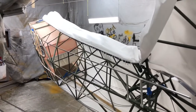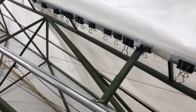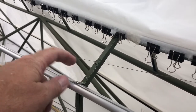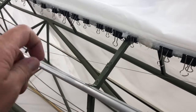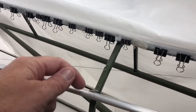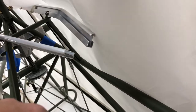What I done is I cleaned those up and made some new brackets. Back behind the paint booth over in the corner — it's just little thin strips of steel, real strong and sturdy, pretty tough to bend. I riveted them to the formers, then turned them up, drilled them out, and put a little sheet metal screw in them. This channel here is kind of arched on top, and this stuff is so strong I don't think it's gonna bow at all like the metal ones did.